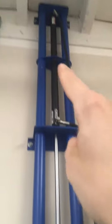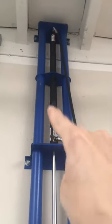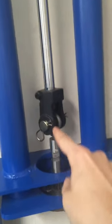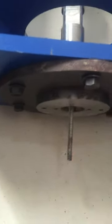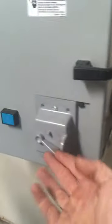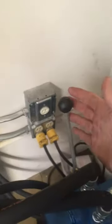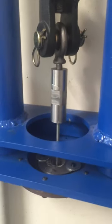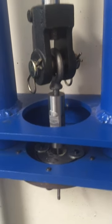Here is the Uber Horn update. This is the draw bench I showed you — remember what a draw bench is? It basically pulls brass through a ring. It uses this cylinder which is extended, and this part here moves. It's gonna pull it through this ring right here. We'll return this, remove this lever, and you can see it move.